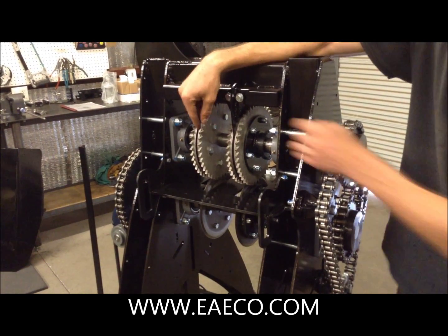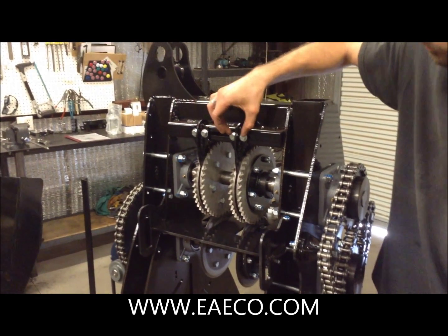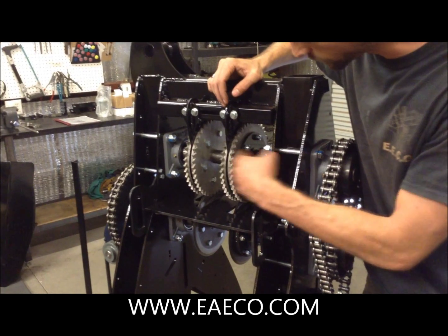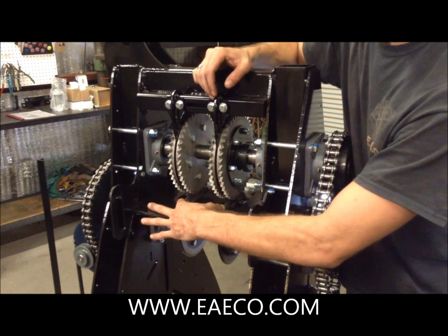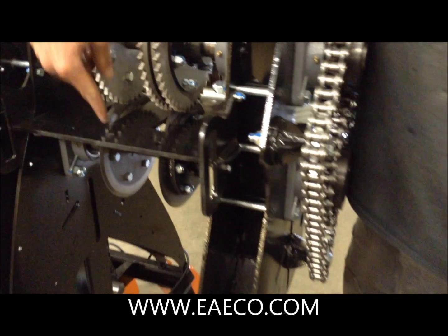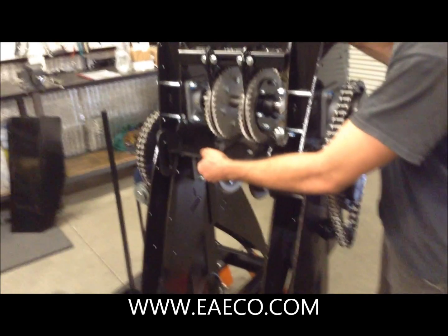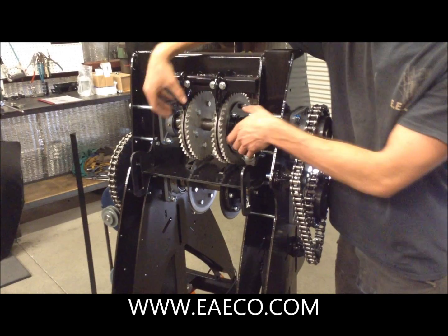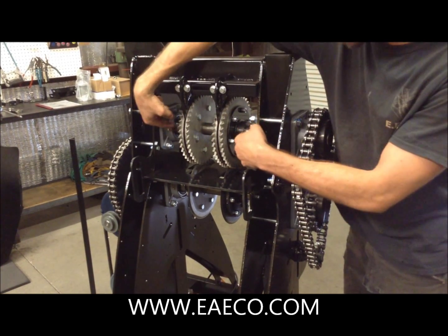To adjust the width that you want, you simply have to loosen up the bolts that tighten the wipers down, all the set screws in the hubs for both the drive wheel assemblies and the blades, and the four bolts that hold the table onto the machine. Then remove the table. With everything else loose you can manually move everything on the shafts.